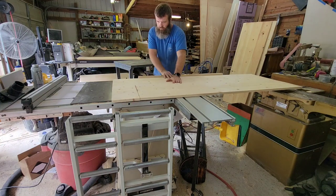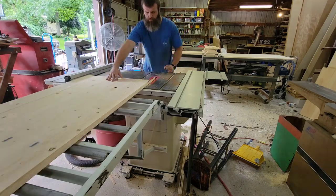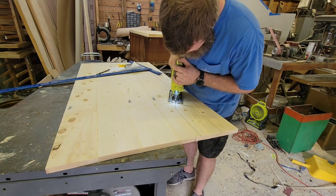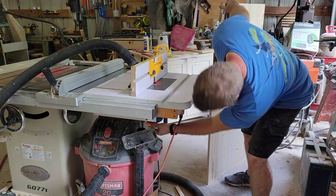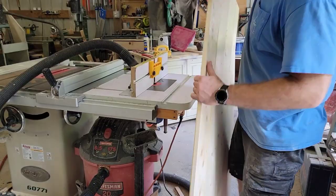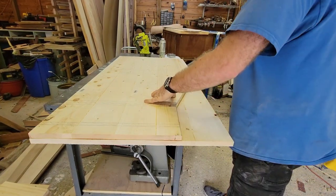Now the panel's dry and I'm cutting it down to size. These pieces were 54 inches — the total height of the cabinet was 60 inches — and 27 inches deep, so just ripping it down. Now I'm cutting the shape on the top of the cabinet; it's got this angled shape and I'm rough cutting it with a jigsaw. Here I'm cutting a rabbet in the back of the panel so that the quarter-inch plywood can sit flush in the back and not be seen from the side. I did that with all four panels.